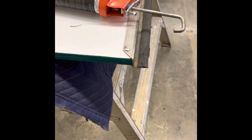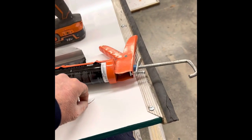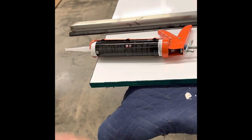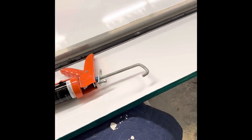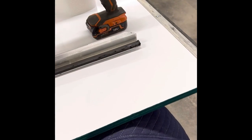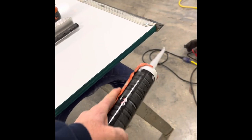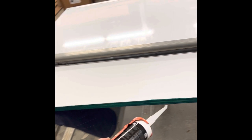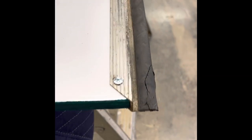Alright, here we are the next morning. Last night we put the waterproof edging on and let it dry — that typically needs about an hour, but it was late and cold, so it sat overnight. This morning I'm showing how I'm waterproofing even more over the waterproofing. I'm applying silicone along the edge, smearing it completely with my finger before setting the flange on, and putting a dab of silicone under every screw before securing it in place.